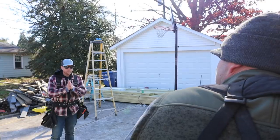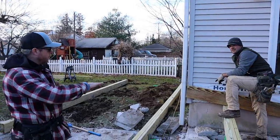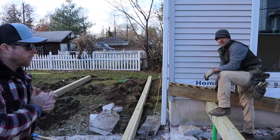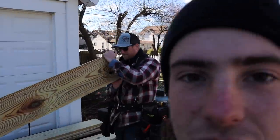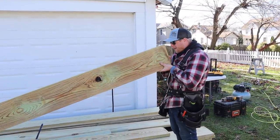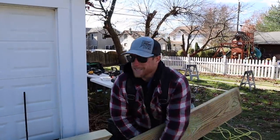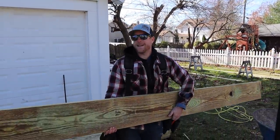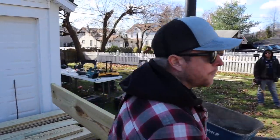What can I jump on to help? Probably get some joists out ready for us. Do you want me to order them according to height, or just lay them in here and plane them later since it's small? We'll plane them later. Just want to check these for crown before we install them. There's going to be a slight crown either way, up or down — you always want that crown facing up.